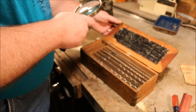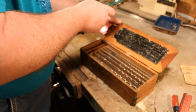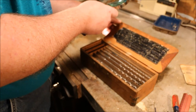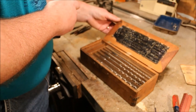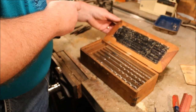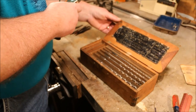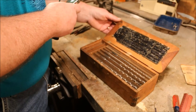The writing on the label says that it contains one each: 4, 5, 6, 7, 8, 10, 12, 14, and 16. Those are the number designations for the auger bits, all in sixteenths. So if the number of the auger bit is 16, it's a 1 inch. If the number on the auger bit is 7, it's 7 sixteenths. Pretty simple.